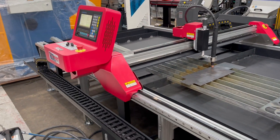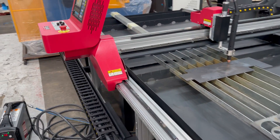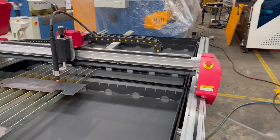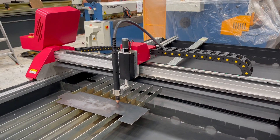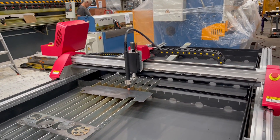It's a bridge style CNC plasma cutter. It runs on a stepper motor on each side — twin stepper motors that operate the traveling up and down. It also has THC torch height control on the machine torch, which can be operated manually or in automatic mode.